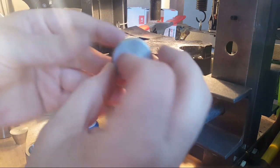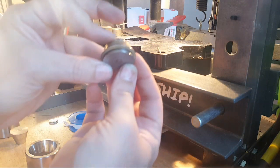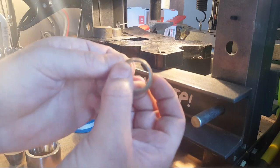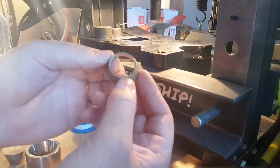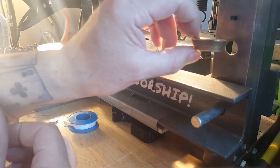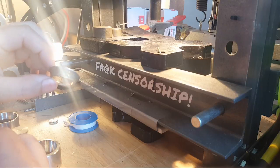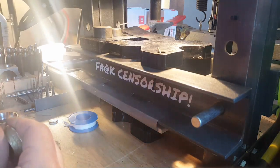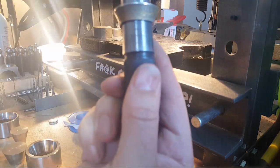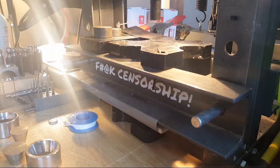The first step goal is to get it to suck up to the cone, and that's where we're at right here. We have a good cut edge - I've sanded that down really well - and we have a good cone shape going. I'm going to heat this up again. Right now on the smaller end it's a size 14. We're going for an 11 and a half, so I may not even need to take this to the ring stretcher, which is great because that's when you tend to get splitting and cracking.